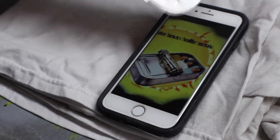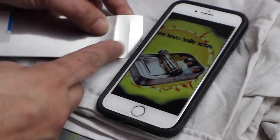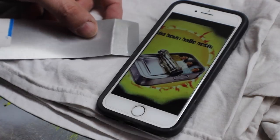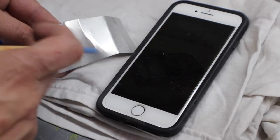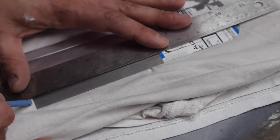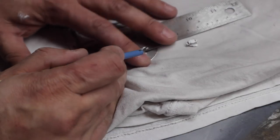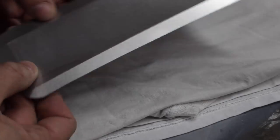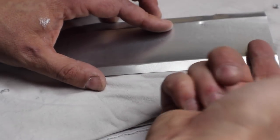What I'm trying to do is recreate this lip. Since this is a flat piece of flashing, it's pretty plain. I want to recreate this lip profile, and after experimenting a little bit with a piece of scrap, I kind of like this profile, which I actually got by running the edge of a paintbrush on it with a t-shirt underneath to absorb some of the force. I think that's a usable profile. So let's lay this out, put our straight edge along it, do the same thing on the other side, connect the ends, and then roll this up.